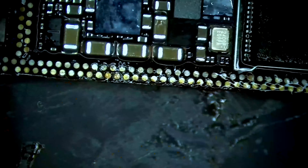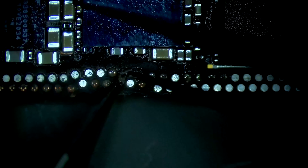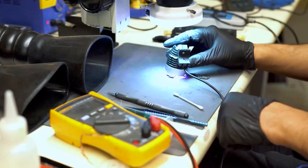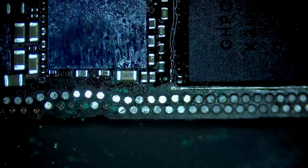First, flatten all the pads on the top and bottom board. Then begin to expose the vias at all points in need of repair and apply a small amount of solder paste. Use the Riwa lug repair kit and install new pads using hot air. Now we can use UV mask to secure them in place. Once the mask is cured using UV light, use a number 11 blade to expose each point.